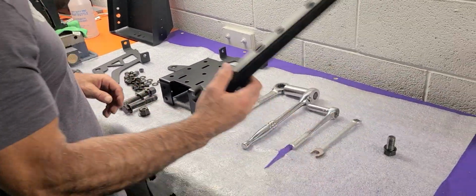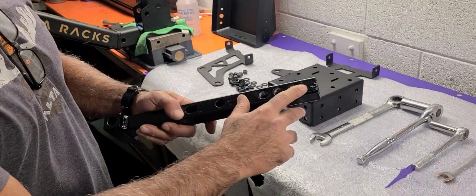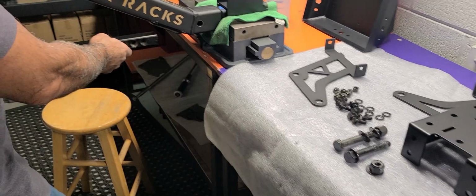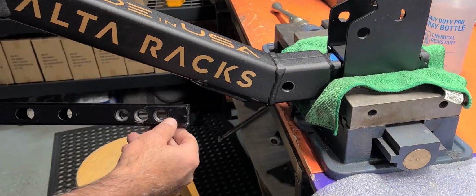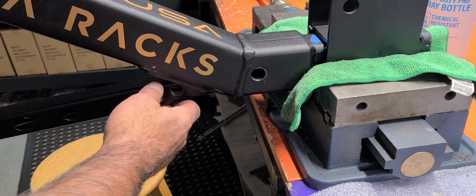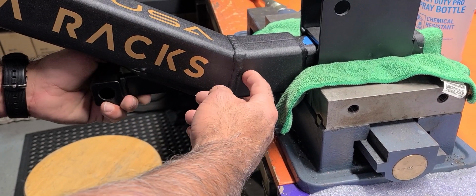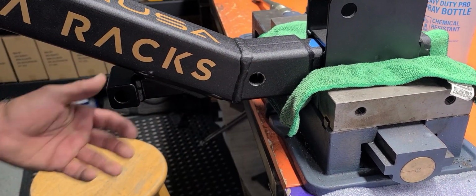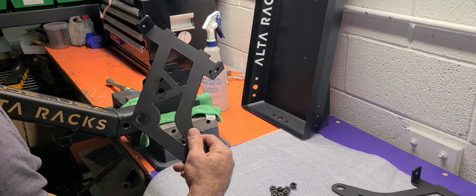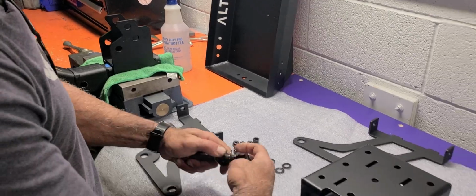So first step you do is you take your bar that has 3 internal stabilizers here and slide it from the back piece in. This automatically will align with the 3 holes in the hitch, so you don't have to worry about that alignment, because you can match that alignment right here with the auxiliary hole. With the auxiliary hole, this is where these plates also come in at the same time. I will get my bolts ready.